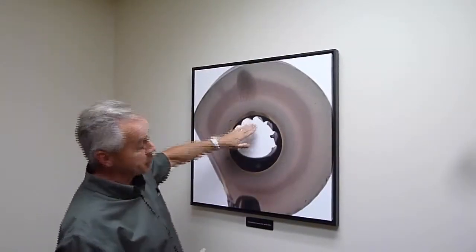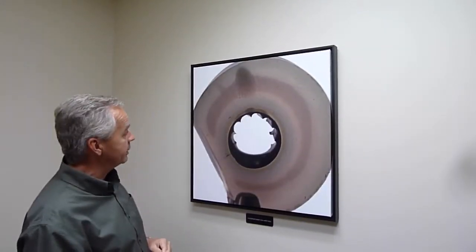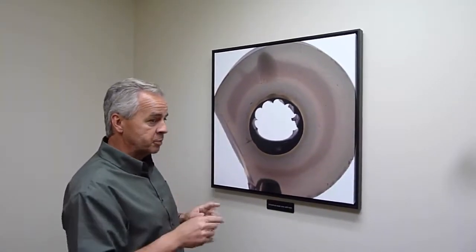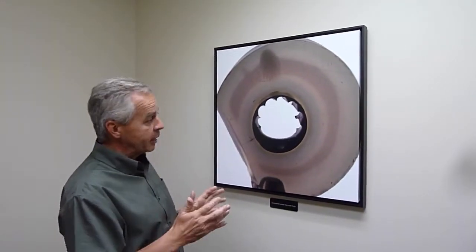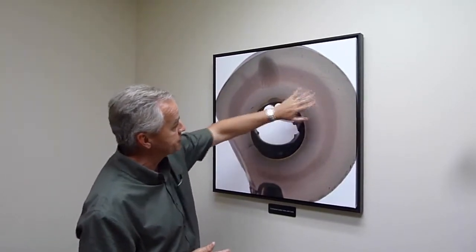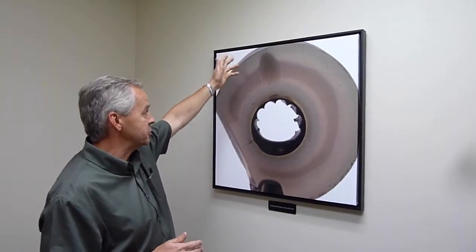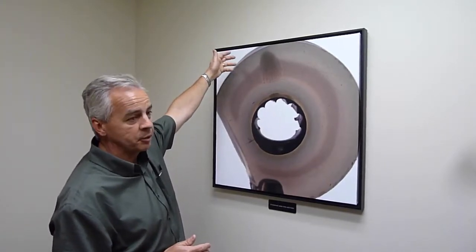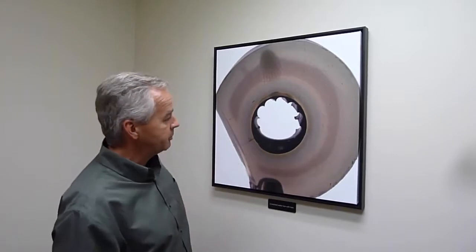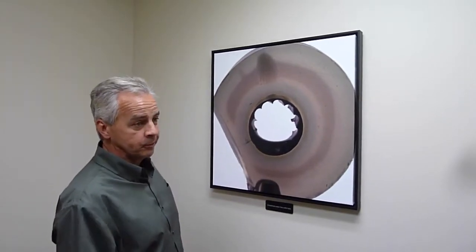The last ones are growing from the inside out, and these ones are growing from the outside in. And they do from both. On smaller cables, like the previous picture, they typically grow from the inside out, because the electrical stress is higher on the inside just from the geometry. But on feeder cables, there's more water on the outside, so they typically grow from the outside in on large diameter cables. But they can be either.